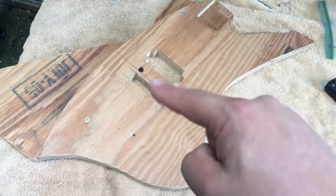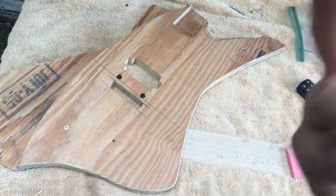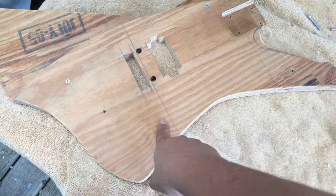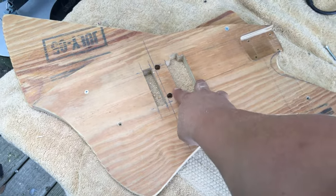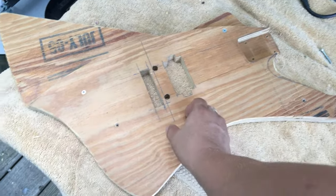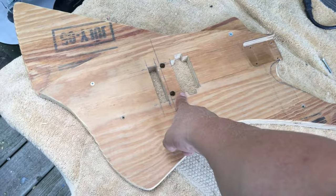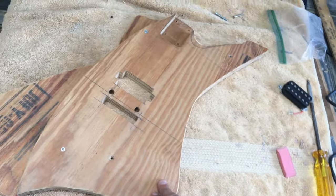Coil tapping is where they wind it halfway and then they get a lead with a wire and then they fully wind it, and it gives you two separate sounds. That's coil tapping. Coil splitting is what I'm doing on this guitar, and the first act guitar is where I'm going to have a push-pull pot. In the down position, it's gonna be the full humbucker. In the up position, it's just gonna be the top coil, because usually there's two single coils that are wound together, and it gives you the noise-canceling humbucker. But when the knob is pulled out on the push-pull, it'll just be the top single coil active, and the bottom one will be grounded out, so it won't actually be heard. So it'll give it a couple different voicings.